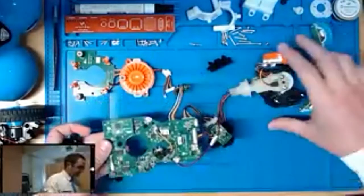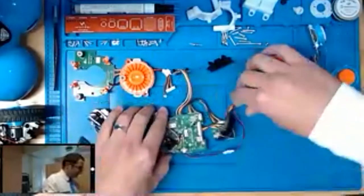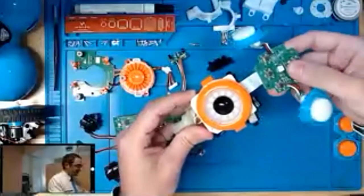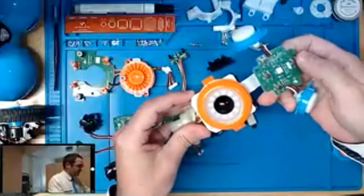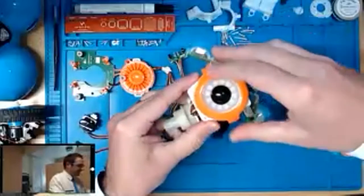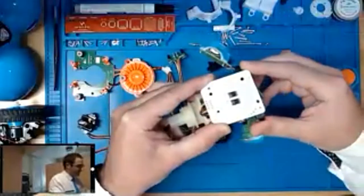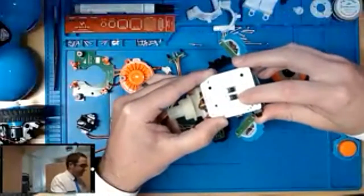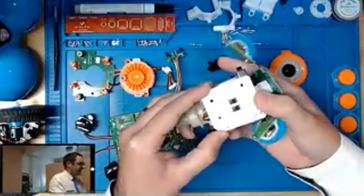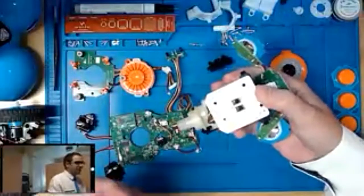Taking a look at some of these smaller boards that are coming off of this main circuit board, we can trace the wire harness up to the head. And so here you can see the familiar eye of Dash. And attached to that, you can see this board with the four buttons, which would be on the very top of his head, and each of the ears, which feature RGB LEDs. So taking off the familiar plastic parts of his eye, you can see what's underneath here. So here we've got the 12 white LEDs in a circular pattern. And inside of that, you can see that there are two infrared receivers. These are used to detect the IR beacon signals that are coming from other Dash and Dots that are in the environment. And that's how they can exchange data and know the presence of another robot nearby.